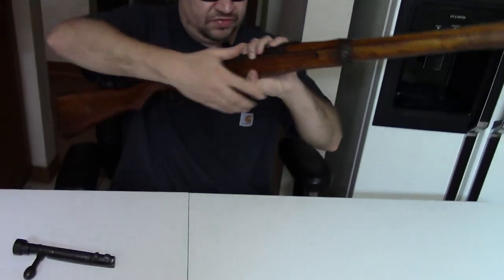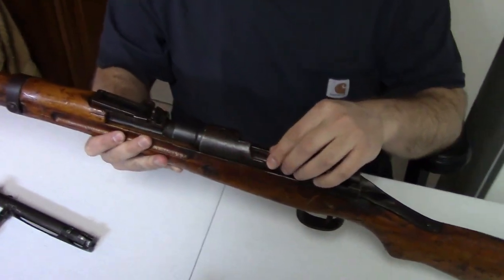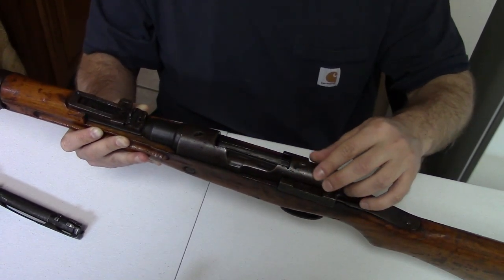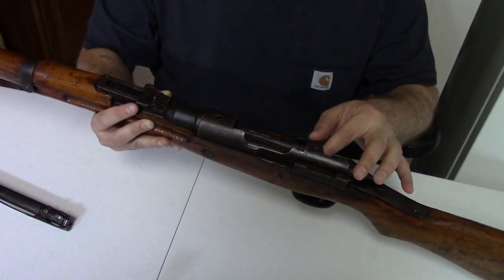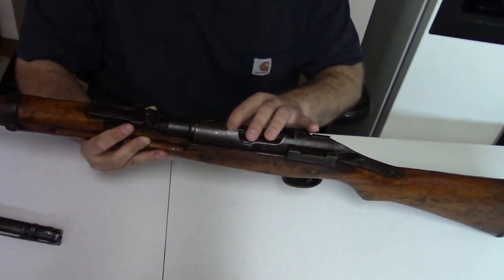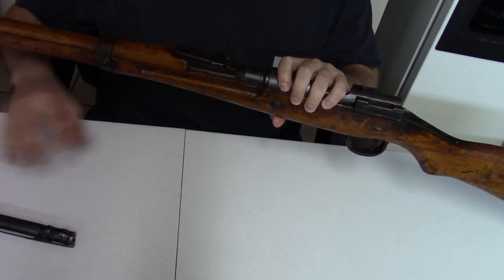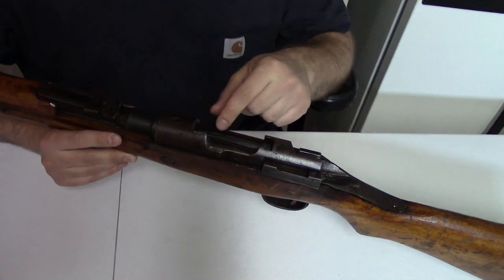On the Naval Special you have a barrel with the extension going into the cast receiver. You can see these pits in the receiver — those aren't points of damage, that's just how these receivers were cast. They knew the receiver wasn't handling really any strain; it's just there to hold everything together, so there would be small inclusions. There's also a naval anchor on this, which is kind of neat. For people familiar with modern guns, having a barrel with an extension using a weaker receiver is exactly what the AR-15 does.